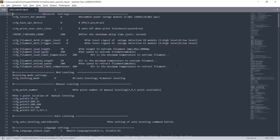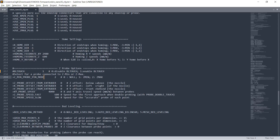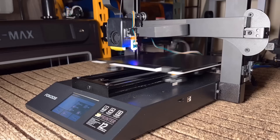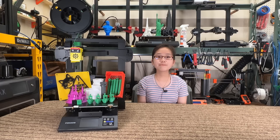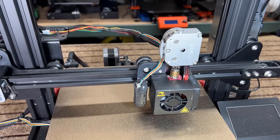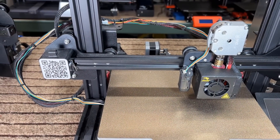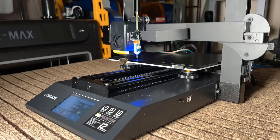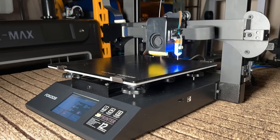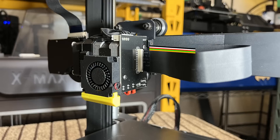Con three: I tried to install a 3D Touch, and although it was usable and fully functional, I have two concerns. First, the MakerBase motherboard firmware is a modified Marlin that moves some variables into an editable text file, which is handy, but it did not include the Z safe homing feature. So when you try to home using the 3D Touch or BLTouch, it probes at the bottom left corner outside the bed instead of the center. I still have to use the limit switch for homing and use the bed leveling sensor to create a mesh. Second, unlike a traditional hot end where you can use zip ties or cable sleeve to organize the BLTouch cable, this ribbon cable has nowhere to attach an extra cable, so the BLTouch cable drags across the heated bed while printing — very concerning when printing ABS at 100°C. The manufacturer could include the BLTouch connection in the ribbon cable and add a BLTouch connector on the PCB.